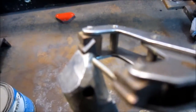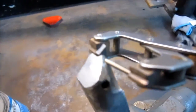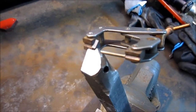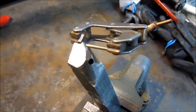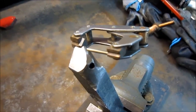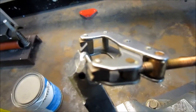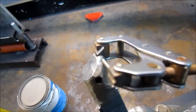You can see that the shim is hanging way out there, and on top of the shim is actually an insert that'll sit on that. Somebody has ground this puppy way back. So what I've done is I've inserted a threaded screw that matches the thread there, which holds the shim in place from the bottom. And I've put the old shim in there that they've ground. What I'm gonna need to do is braze, build up braze, so that that shim is not cantilevered out that far. I don't think this is focusing very well.